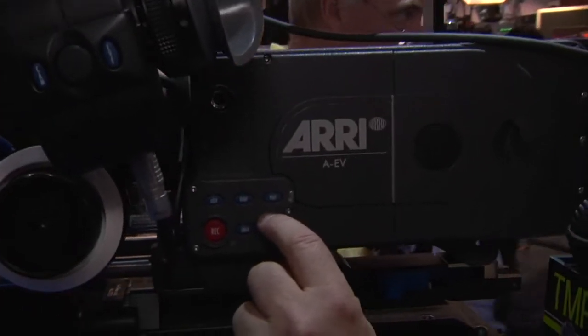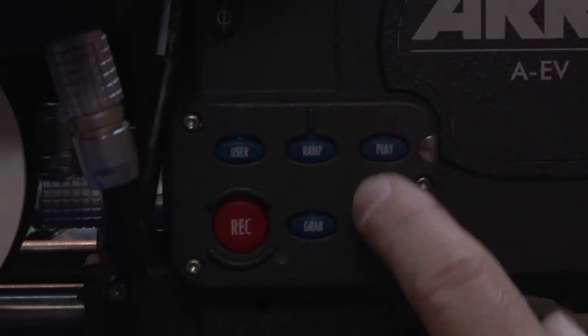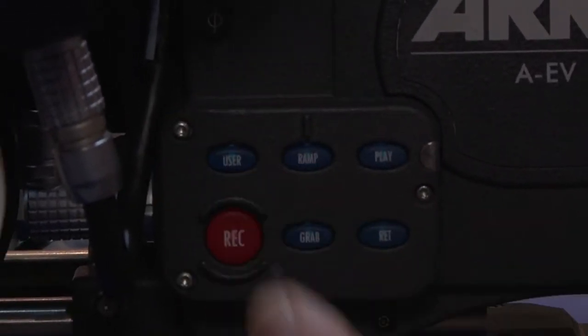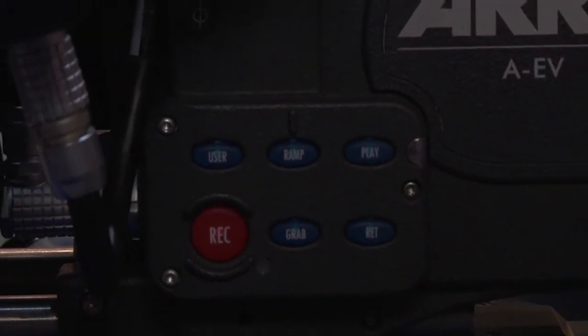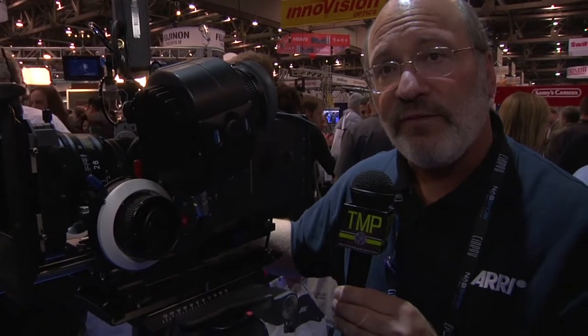On the operator side, in the finished camera, these three buttons will be assignable buttons. You'll be able to go on the other side and select what you want to set these functions for — so let's say you want to select ramp, frame rate, and ISO; just by pushing the button you'll be able to select those. These buttons can also be locked out by selecting the lock on the other side. The record button is also recessed. There's a play button and a grab button: the play button lets you play back the last scene recorded on the SXS cards, and the grab button lets you select — with an SD card that fits in the bottom of the camera — to grab an ARRI RAW still, a TIFF, or a JPEG.